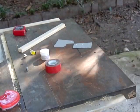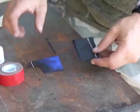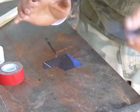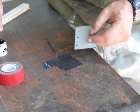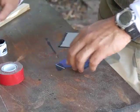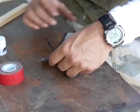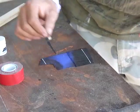I'm on a steel surface, so I'm going to show how the magnet trick works. This is the type of cells that this works excellent for, because if you try to tab wire these together you're going to take up a huge space and it's going to look really rough. This will give you a more professional look. So I'm going down this gray surface and putting just a touch of glue on there. When you use the magnets, it gives you an actual better bond — but you've got to be careful. You can do this with full cells too, just make sure you know the pull strength, because too much and you can smash the cells together and you'll have more pieces.